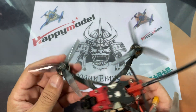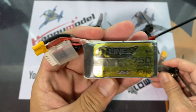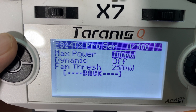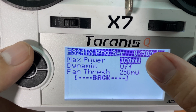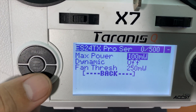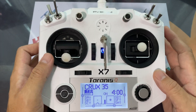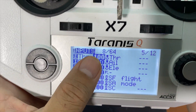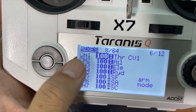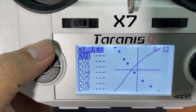It's got my personal binding phrase, same props and same lipo, so nothing's changed except the radio. On my radio I've got the ELRS module set to 100mW, but on the Jumper T Light it was set to 500mW, so that could be the cause of the jitters. It's also the model settings, so you might want to check that out. If your quad is giving you jitters, make sure all the inputs and mixes are done right. Hope you enjoy this video of the Crux 35.